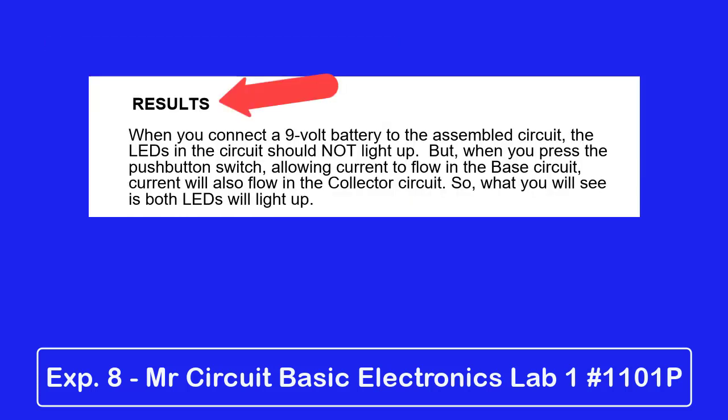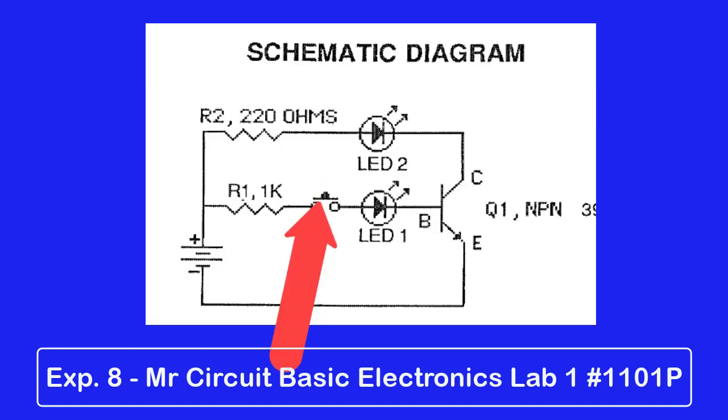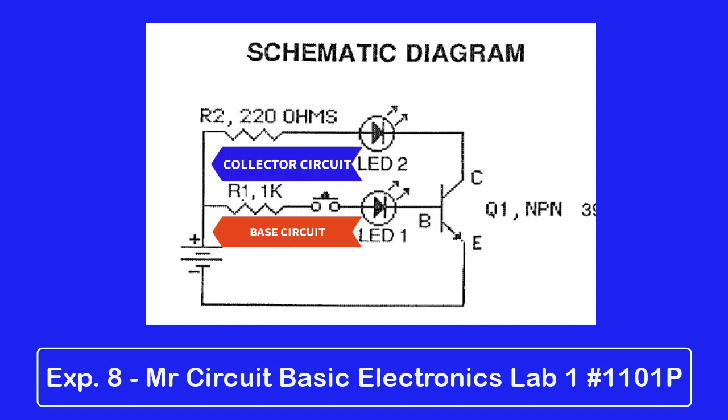Results: when you connect the 9-volt battery to the assembled circuit, the LEDs in the circuit should not light up. But when you press the push-button switch, allowing current to flow in the base circuit, current will also flow in the collector circuit. So what you will see is both LEDs will light up.